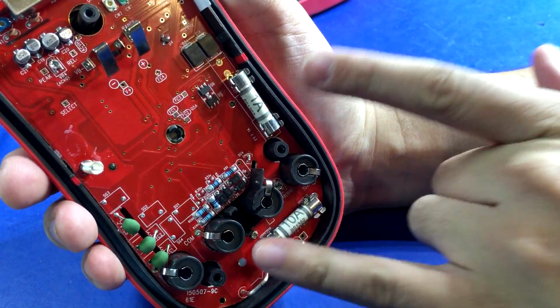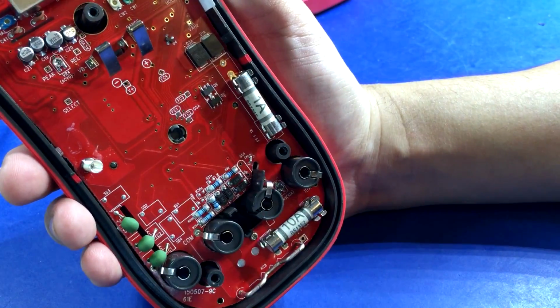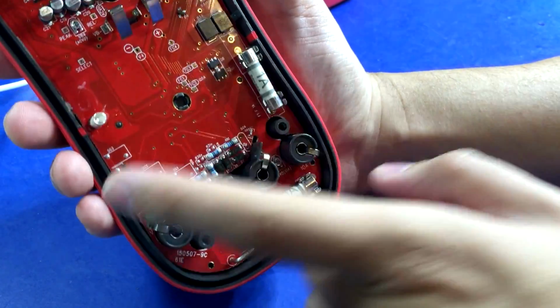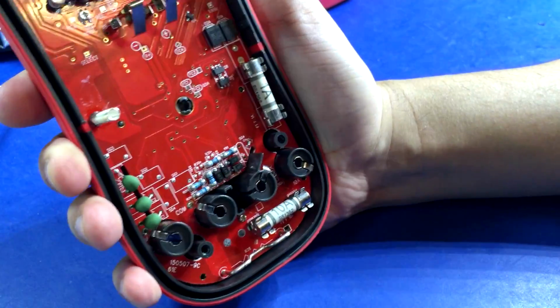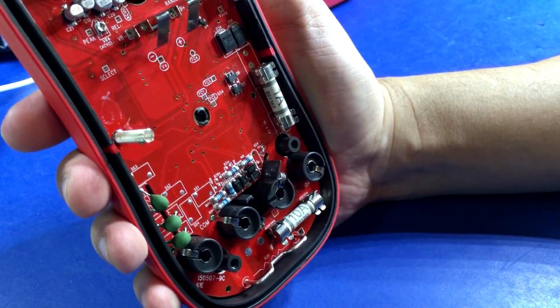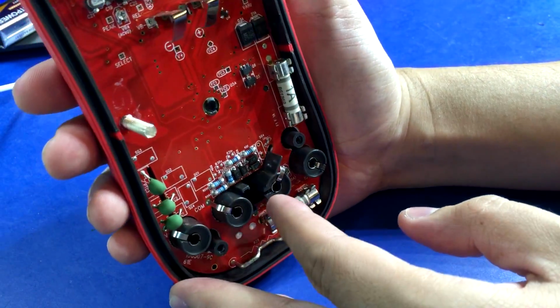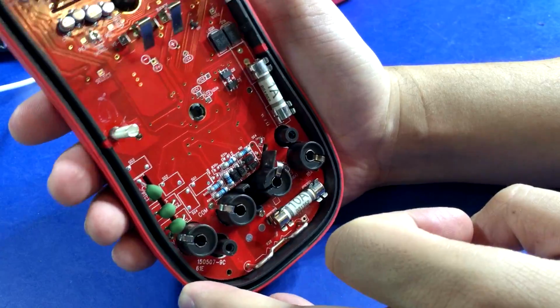It could definitely do with some bigger fuses, and PTCs are fine, I guess. A varistor would be good for soaking up some transients and clamping the voltage when it gets high, but yeah, I really don't have any complaints.